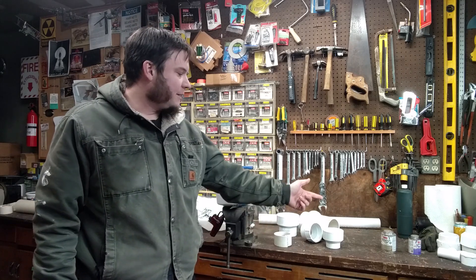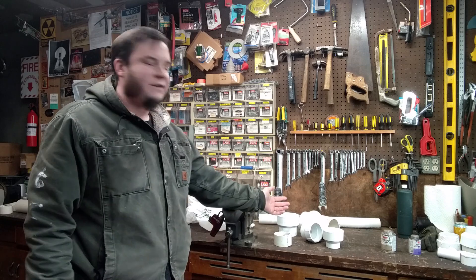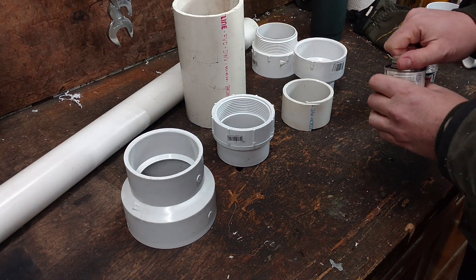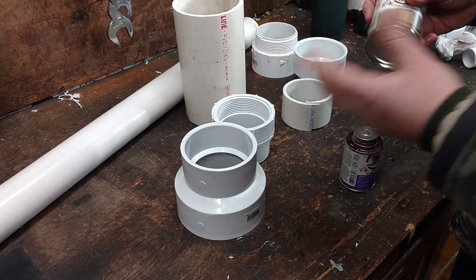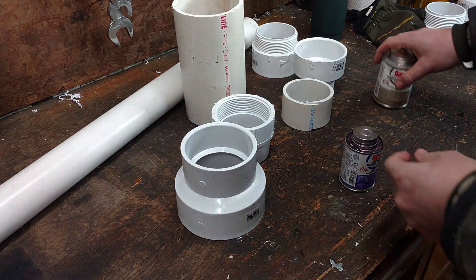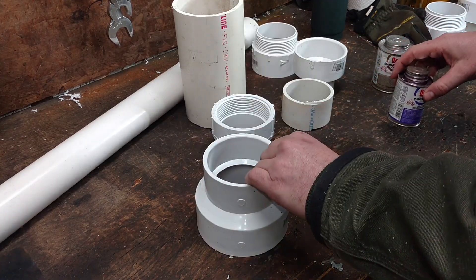While I'm waiting for that epoxy to set up, I brought my pipes inside briefly to let them warm up a little bit. It's currently about 40 degrees out here, which is borderline for the PVC cement — it likes to be somewhere between 40 and 100 degrees. I brought the cement inside to warm up too. I don't want to actually do the cementing inside because it stinks and puts off some fun fumes. So I'm going to go ahead and glue these pipes together. This is essentially no different than normal plumbing — we're just using the purple primer to clean and prime the surfaces, and then this PVC cement to adhere the pipes together. It sets up pretty quickly, so you want to make sure you have everything in the right place when you're doing this.